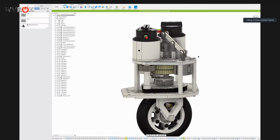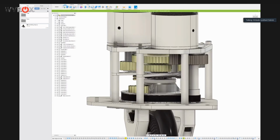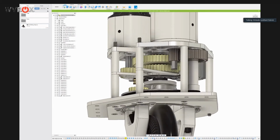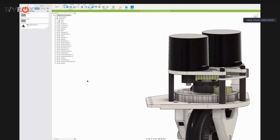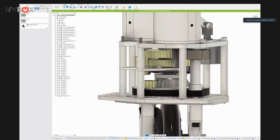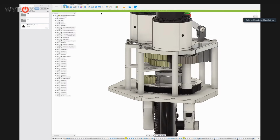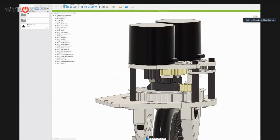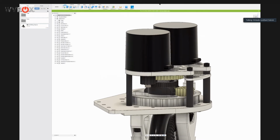Some of the things that we learned from our previous set of modules and our experience over the season, and that are implemented here, one of the biggest ones is the encoder. So on the Mark II module, which I can pull up here, it's actually a set of gears with the absolute encoder. And we didn't have too many problems with it, although in competition at least. In our earlier testing phases, because the gears were all 3D printed, and the hub that went on the encoder shaft just had a set screw in it, there was nothing actually positively keeping it together.